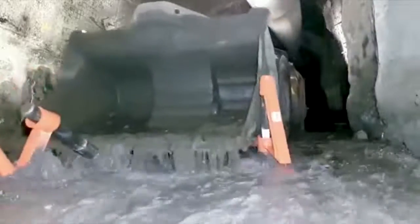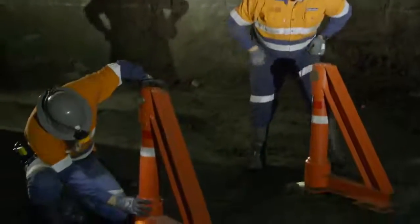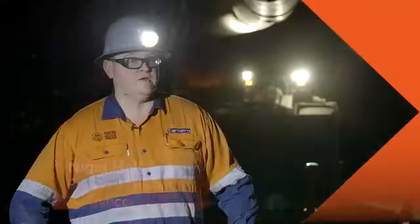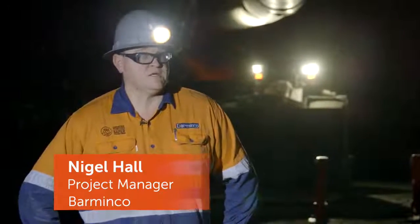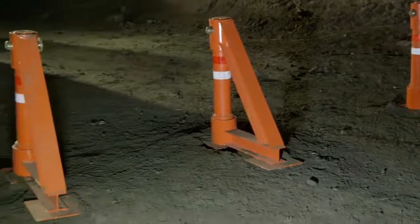These poles had to go through rigorous testing to get the right mix of strength versus weight versus easy capability to deploy in the underground environment. The steel bollards themselves are made of 150mm tubing, which is a steel carbon composite, making them lightweight enough to move with two people but strong enough to stop a fully loaded loader from approaching the edge.